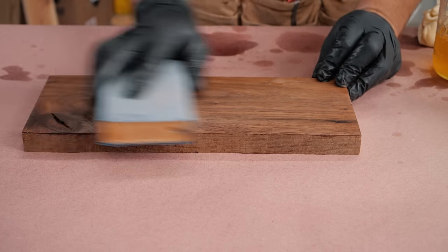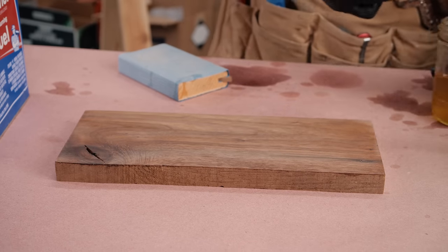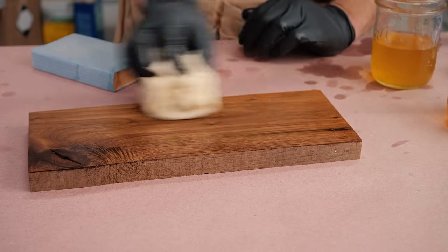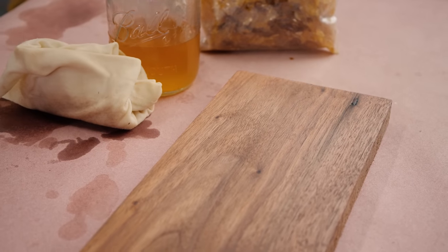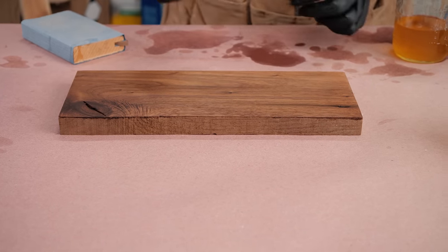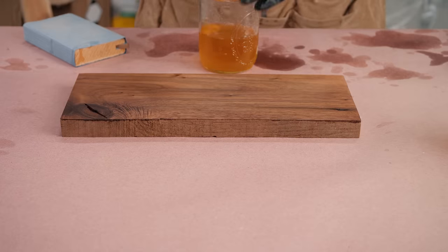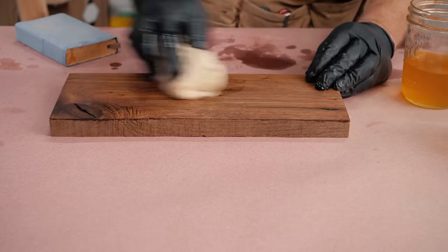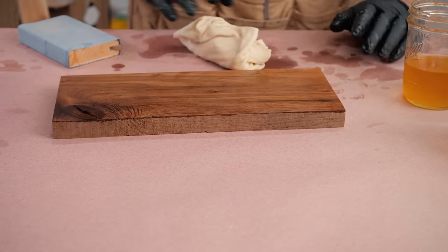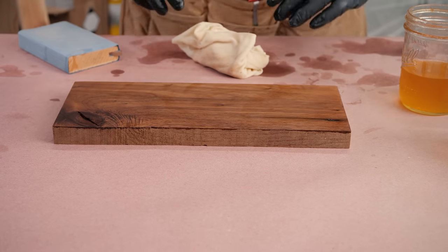I'm just going to give it a very light scuff sanding, then add a little bit more denatured alcohol to my mix, give that a dunk, and give it one more nice coat. You don't want to keep rubbing — if it starts to tack up, just back off. You can always come back and fix it once it starts to tack. So now you could call that done. It's beautiful, nice matte finish — it looks like an oil finish, not a film finish. Or sometimes I'll go one more coat, dip my rag, ring it out really well, and give the surface a light buffing to help blend in any inconsistencies. Look — that's already about dry. You can see the shine go away — it dries so fast.